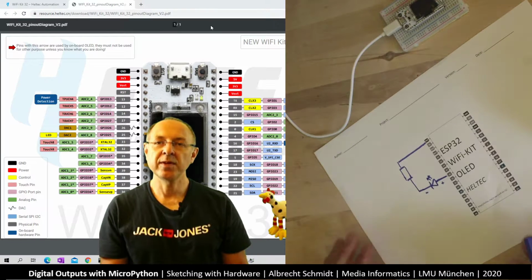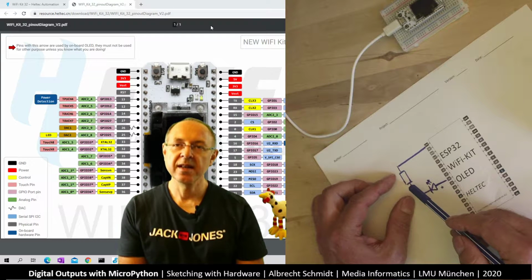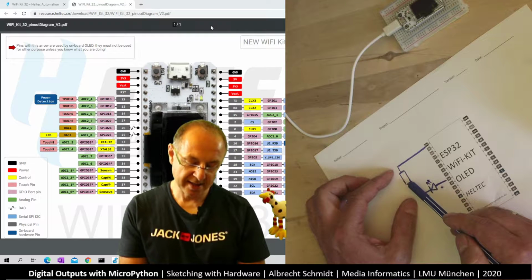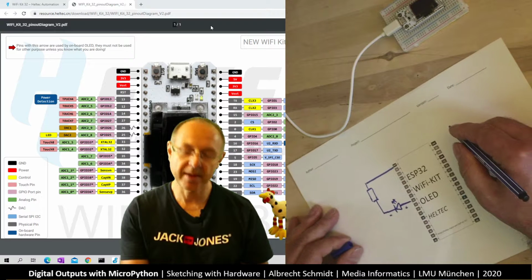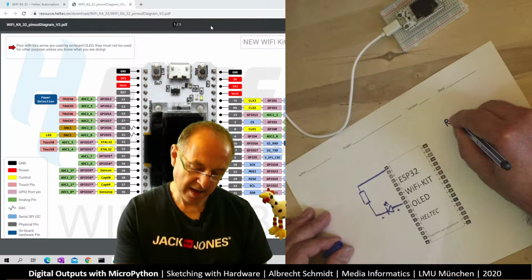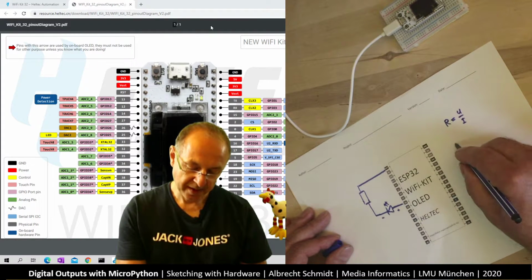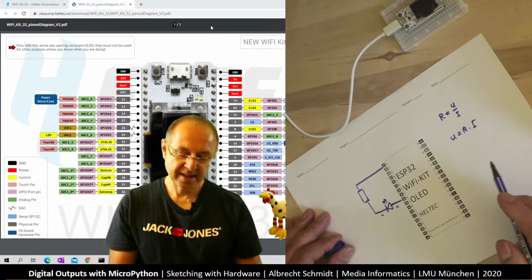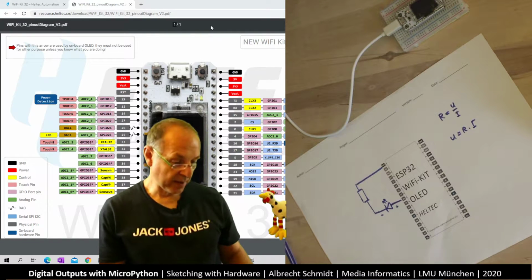And if we have a resistor, the current that goes through the resistor is dependent on the voltage on the resistor as well as the resistor itself. So there is this common equation, R is U divided by I, and we can also now look, U is R times I, and typically we are interested in the resistor. So I give it away here.